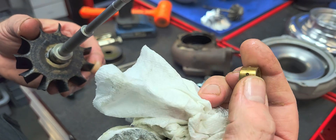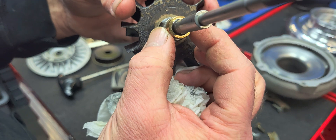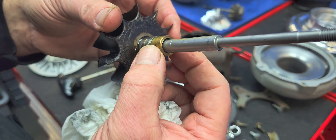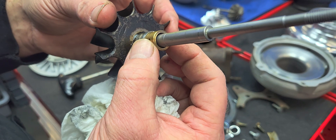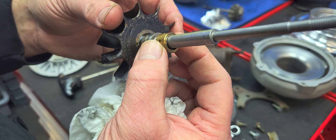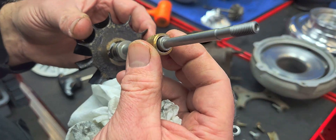There are no marks on these bearings to know if it was a standard, undersized, or oversized bearing, or who made it. But basically it is, give or take, three-thousandths of an inch out. Front compressor side — same way.